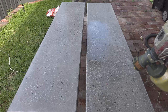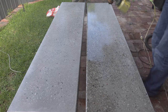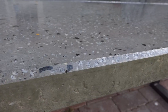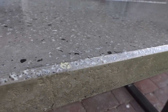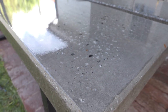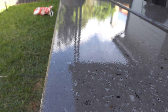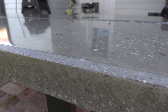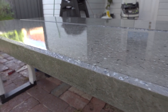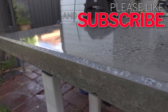Thanks for watching, hope you guys learned something — I certainly learned a lot from doing this. Things I could definitely improve on: getting a better finish initially with the trowel. Here we've got some orange peel effect in the sealer — I've since been told the way to fix that is thinning down the mixture further. The other thing I'd probably do is trowel up the sides a little bit more to seal them and get a better hone finish on the sides. Really happy with how the corners came up with the router — that worked great. I'd probably also make them a little bit thinner. Thanks for watching, hope you enjoyed it — please subscribe, like, and comment.